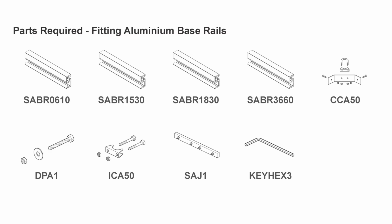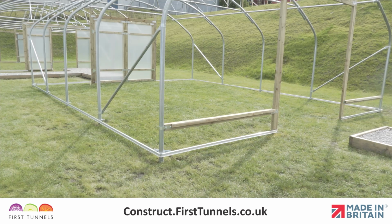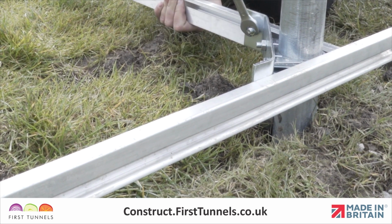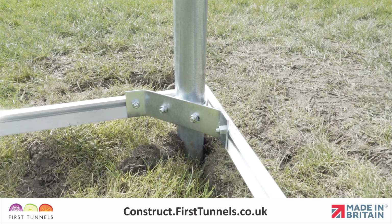Here are the parts you'll need. The aluminium base rail is made up of lengths of aluminium rail, which are 61 cm, 1.53 m, 1.83 m, and 3.66 m. The base rail fixes to the outside of the framework with the T-slot internally facing and the cover fixing channel towards the bottom. It is attached to the framework using intermediate clamps and corner clamps.